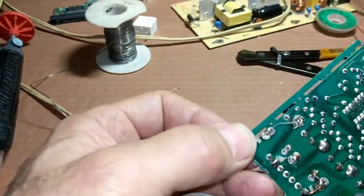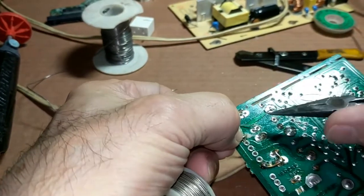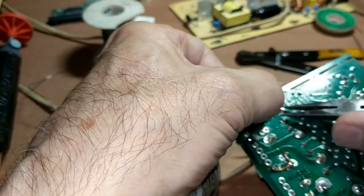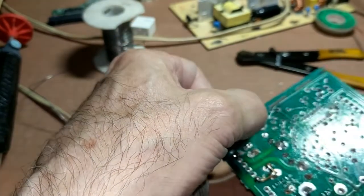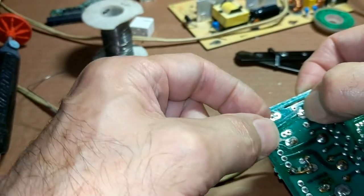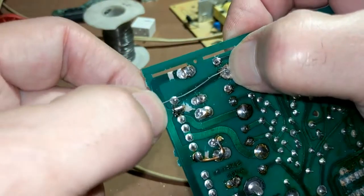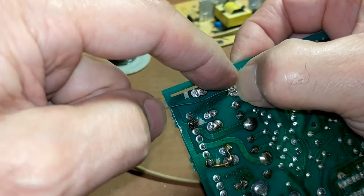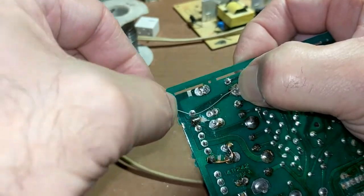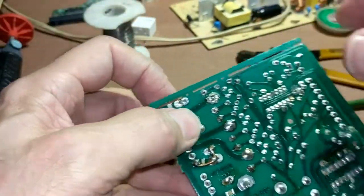Let's say this is your burned pin — put a jumper wire on that. Let me do the bigger pin because it's easier to get to. Then run down to another spot on the same trace. You can see that trace goes from here to here, so I want to connect to the same trace. I could come down to here and solder that onto there.